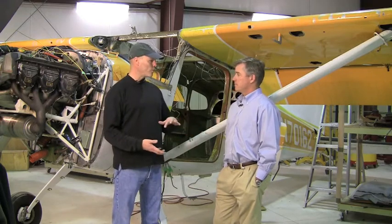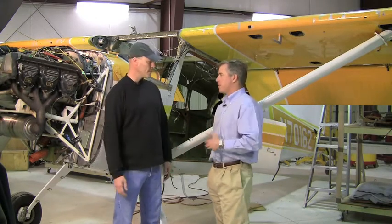What we're going to be doing is, once we're finished with the corrosion preventative treatment and all the wiring that's going to be covered up by the new interior, we'll be going back with a closed-cell foam insulation — half inch — which will encompass the entire cabin and the rear of the firewall. Over top of that will be all brand-new fiberglass paneling, which is STC-approved, developed by a company back east and made to our specifications and color. Then we'll put in new seats with memory foam — NASA-type foam — for comfort, and vinyl instead of the old cloth. So it'll be totally retrofitted; when you get in it, you'll think it was a newer Cessna airplane. It'll also be a quieter airplane with the insulation and soundproofing.